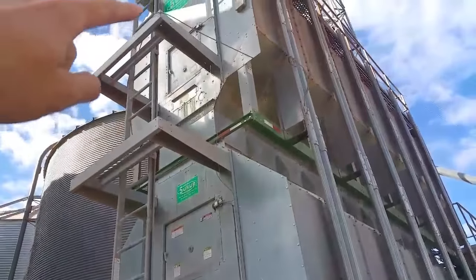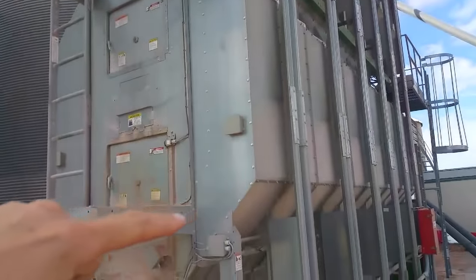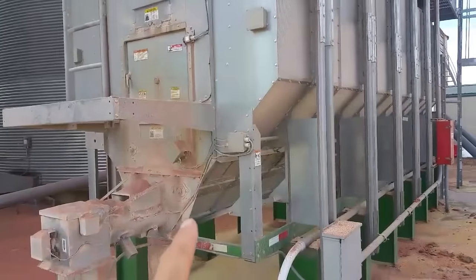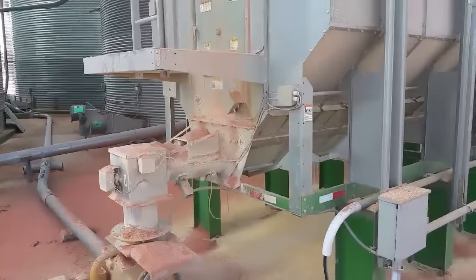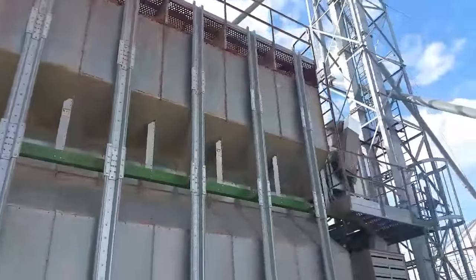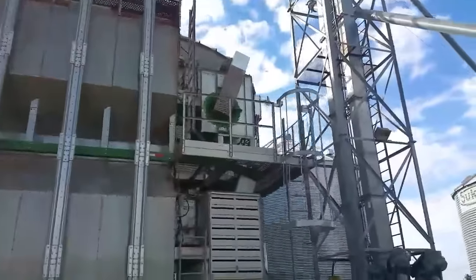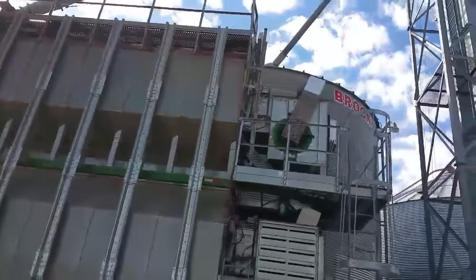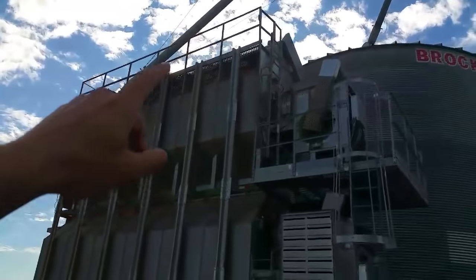So it crosses here and it slowly works its way down through the walls as it's being heated and air forced through it until it gets to this auger at the bottom and gets sent out into the air system. So the grain's all in the walls. That's how that works. And right now the top one will heat the corn up. The plenum temperature is what the inside hollow part is called. It's the plenum. The temperature is set at 215 right now as the corn runs down.